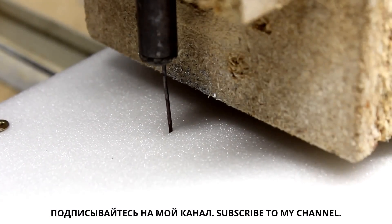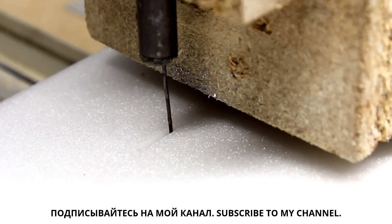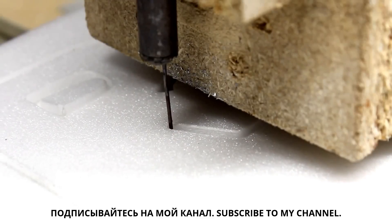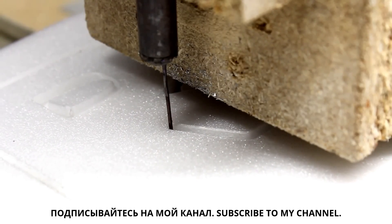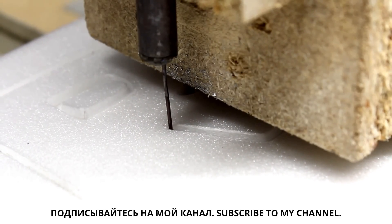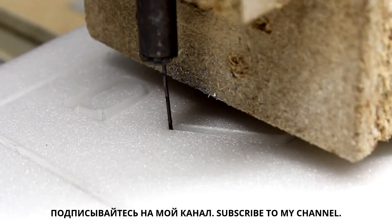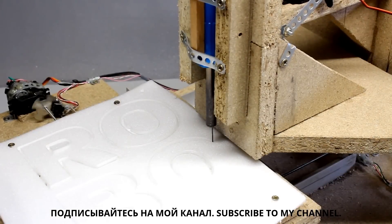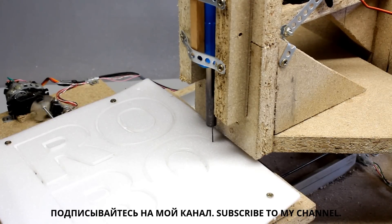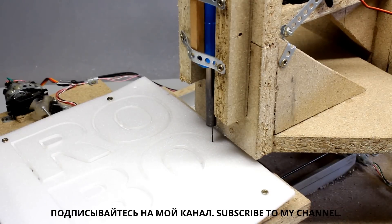The 3mm plate of depron processed here can be cut very easily. The material isn't cut with a router, but by using a soldering iron with a 1mm copper wire at its tip. Consequently, processing depron with that CNC machine is more quiet. The length of the copper wire should be chosen such that the temperature is just enough to melt the depron — that reduces the bad smell of evaporating plastics. The width of the cutting line is approximately 2mm and there is almost no side load on the tip of the soldering iron. Depron is cheaply available and it is a proper material to demonstrate how a CNC machine works.